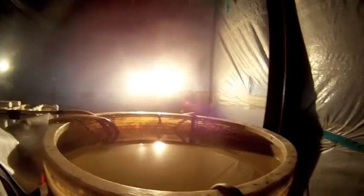All the debris and water is vacuumed down this line and is brought into the separation system, where the lead and other waste are separated into these 55-gallon drums and then stored into this tank after being processed. The processed water is then pumped through a twin filter pack, 5-micron to 1-micron water filters, and out into a waiting container where it's tested for purity.